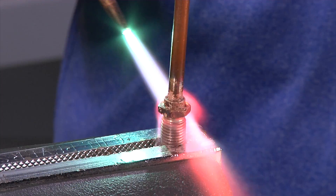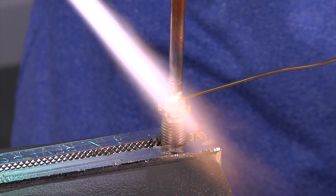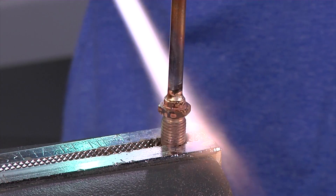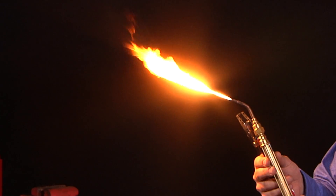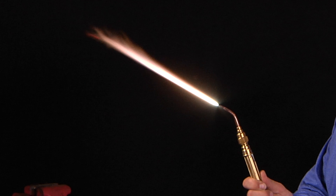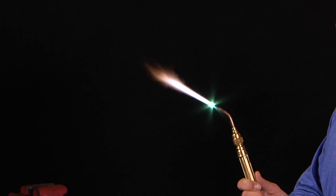You'll need to bring both of the pieces you're brazing up to temperature quickly and evenly. This allows the filler metal to wet equally well on both metal surfaces and completely fill the joint. We're going to use an oxy-acetylene torch as the heating source. A torch tip that's appropriate for the part size has been attached.